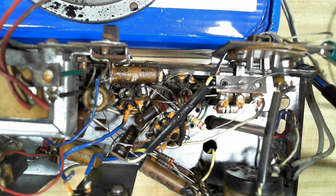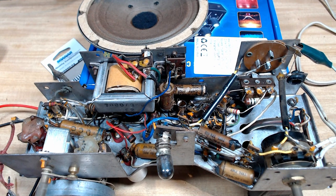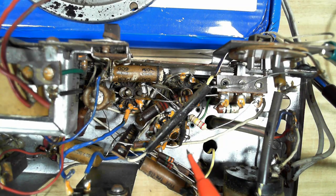Many. Okay, there it is. So is this that resistor? I started to say I didn't put that resistor in properly because it's so hard to get in there. I've got to change all these capacitors anyway. But it does work. There's very little hum. Notwithstanding, I'll still change those to electrolytic capacitors because if they haven't failed now, they certainly will not get any better. And I guess, what are they, about 70 years old? So they've lasted pretty well, actually.